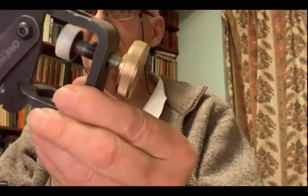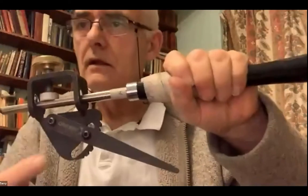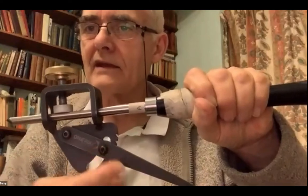Yeah, this is the jig that grinds gouges. You would put the gouge in. Set that distance. You can use just a simple stop that would do that. But this angle here, there's a pivot point there and a lock there, so that arm swivels. And I use this little template. It's just two bits of stuff. Having got it right, you get it as you want it, and then what you've got to do is be able to go back to that same setting.